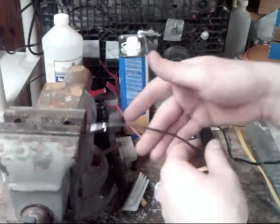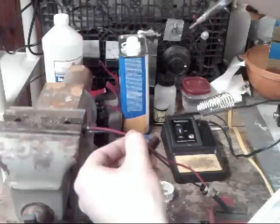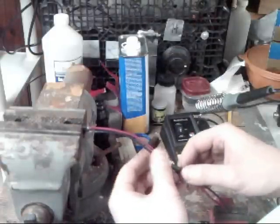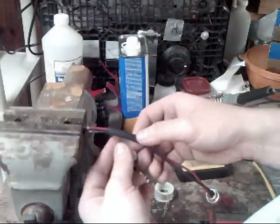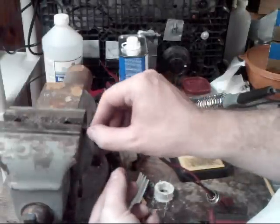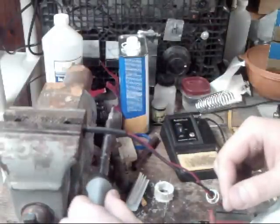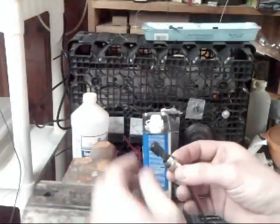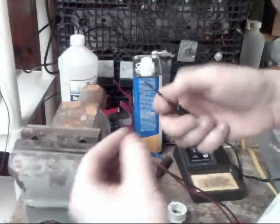One down. Straighten out the wire when you take it off. Now the wires are not touching. Maybe you should put the collar on first — I did put this on upside down though. Just jam the heat shrink tubing up as high as it goes. The hottest part of your soldering iron is actually right in here. Slide up the collar. You can take everything out of the vise now. Then start reapplying screws.